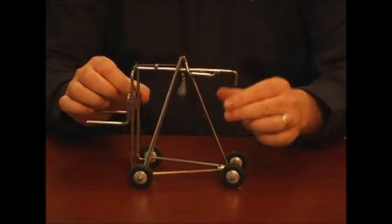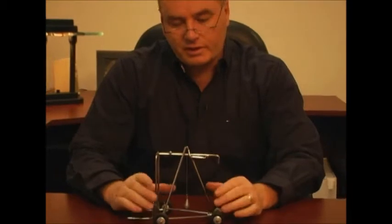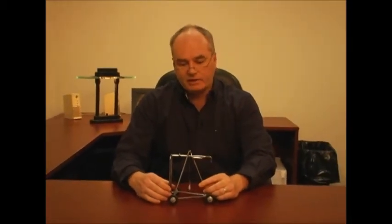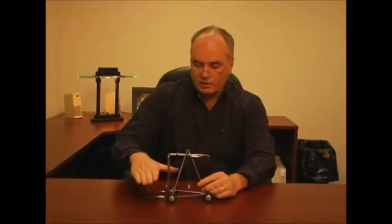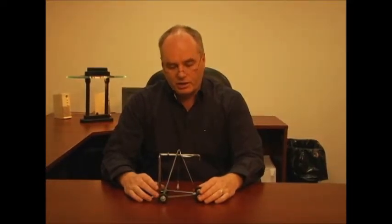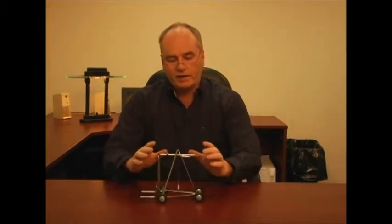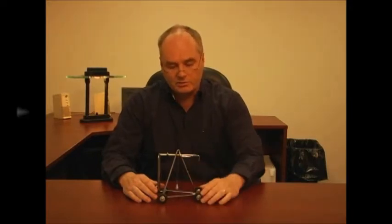So these are some of the basic principles that the wire lift truck has. And one good thing is they can put their hands on it and they can play different scenarios. You can put loads on the forks just to represent different scenarios that your forklifts have to operate on a daily basis. The one thing you should mainly know is that the number one cause of death of a forklift operator is a tip over situation. And that is why the wire forklift is such a great training aid to help them understand what keeps a forklift stable.